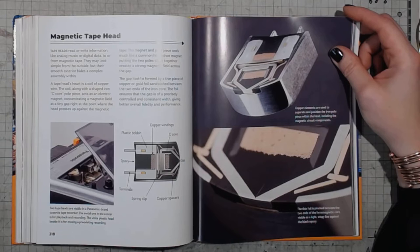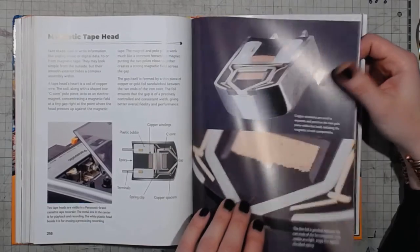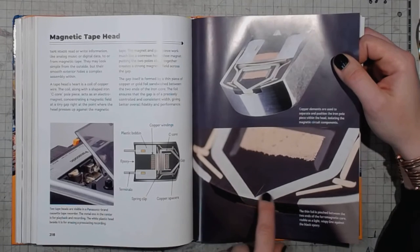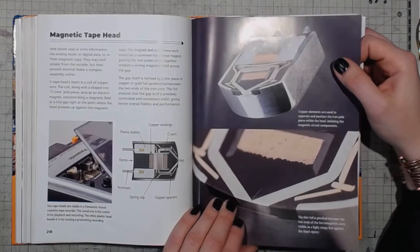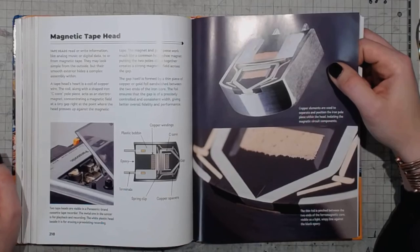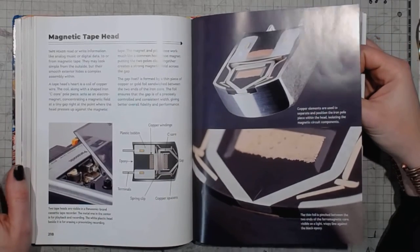Also an almost forgotten tech. If you have a tape machine, whether cassette player or reel-to-reel, then you will have one or two of those tape heads. This is how they look like, this is how they are built. They have a very narrow slot between the poles, and the narrower the slot, the higher the audio quality is, the more precise the component will be. The more bandwidth, then the less distortion.